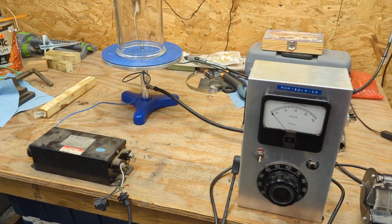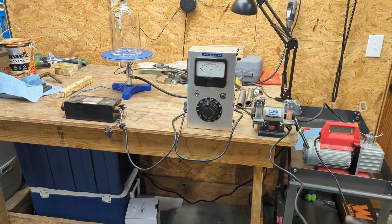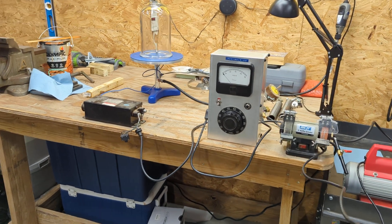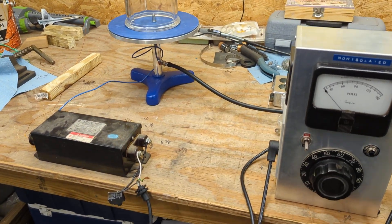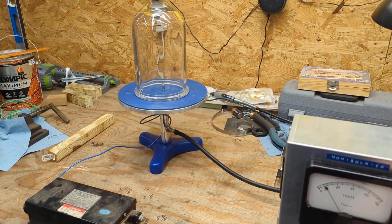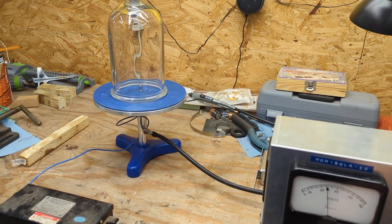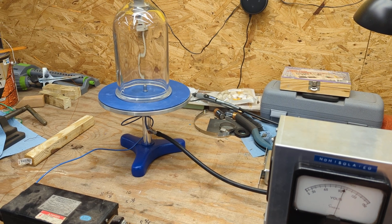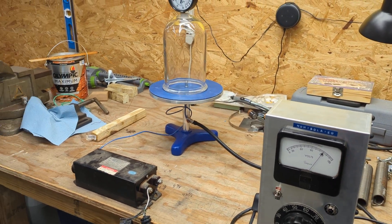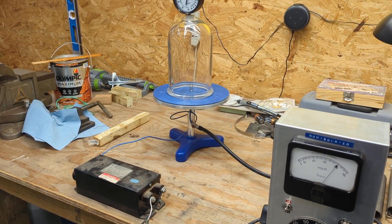I'm going to take the power cord, which I leave disconnected while I'm close to the machine, and we will plug it in and then start generating vacuum as soon as we increase the voltage just a wee bit. The vacuum pump makes a terrible bit of noise, so I'm going to wait till I turn this on first. This is in atmosphere — I'm increasing the voltage. This is in the primary winding, so you're not seeing the output voltage; it's going to need thousands of volts on the output. So we're going to get to maximum power here, and there's nothing going between that gap right now. That entire thing is cursed high voltage — any of that is probably lethal. So it would be bad to touch that plate right now.